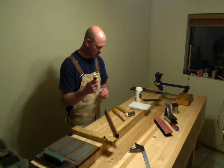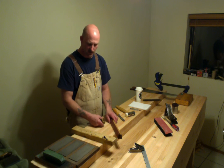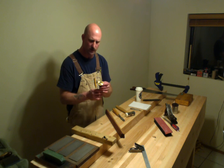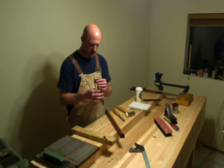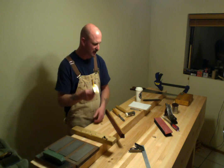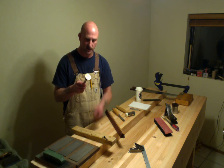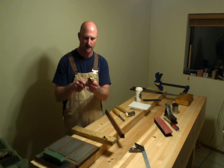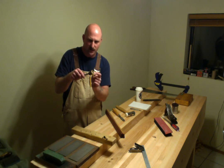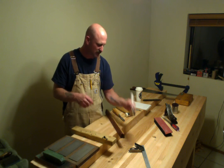This is used in woodworking to mark lots of things, thickness of boards. Well, mark anything you want with it. But you can use one or both posts in this case. I'm actually going to get another one, a single post that has that micro adjustment on it. There's so many times I've picked this up and wished I had that micro adjust, but I don't, because this is a pain to try and get both of these 3/4 inches apart and at the right distance away from this base. That's a pain for any marking gauge, but that micro adjust would help a little bit.